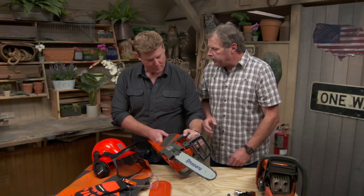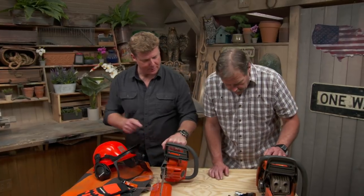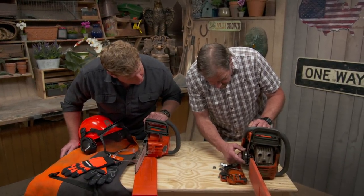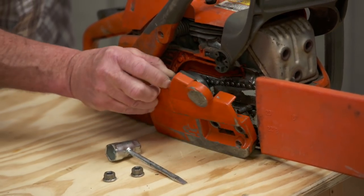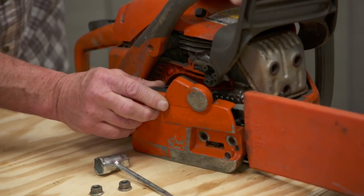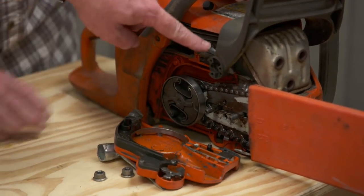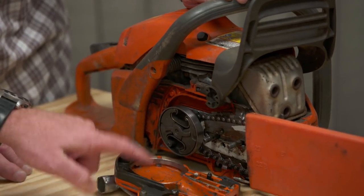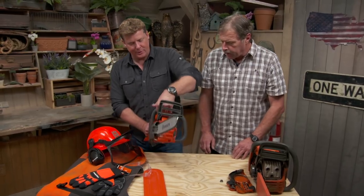So you've just protected your arm and forearm from getting cut. What's actually going on when it goes into brake mode? This turns the chain — this is the main sprocket that goes to the engine. On top of it, we put this piece and it actually slides on. When you go to lock the handle, it tightens right around this. So this moves, which moves that, tightening this, which will just stop the chain right down. That is the built-in brake feature.